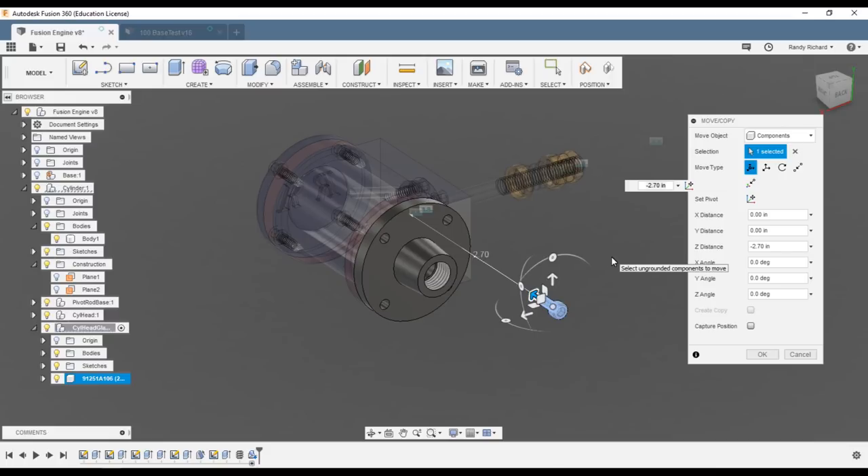The history line is getting very long — we have a lot in there. If you can shorten it, there are fewer calculations the model has to do. That's why when you add many parts it takes longer to regenerate and save. That's why you use sub-assemblies. I'm going to do the crankshaft and piston rod as two separate sub-assemblies to show you the difference.